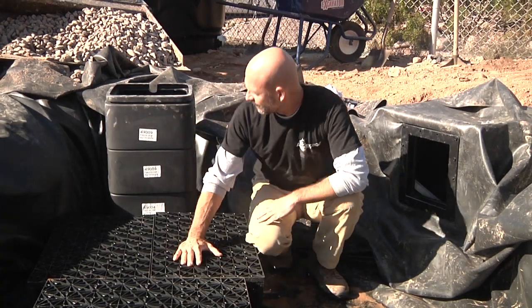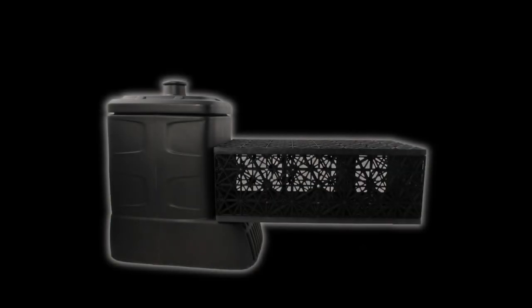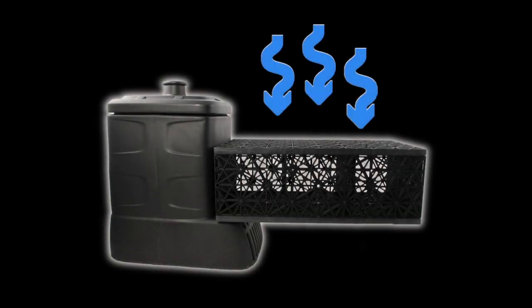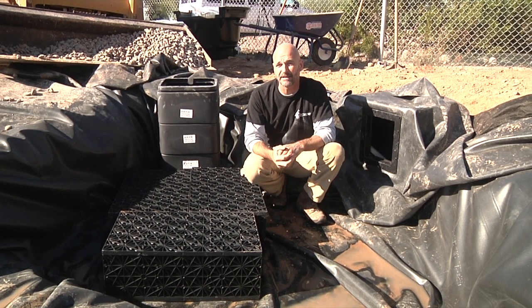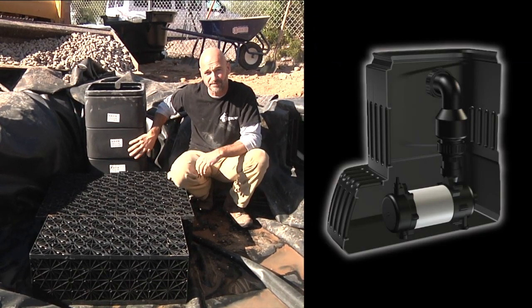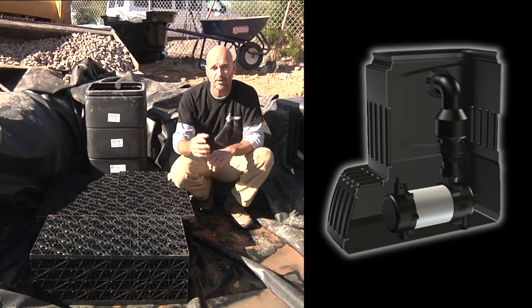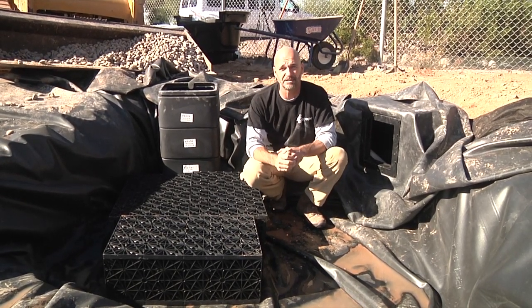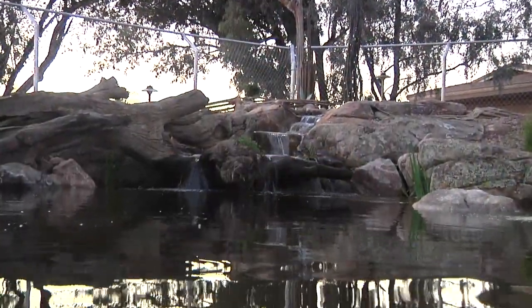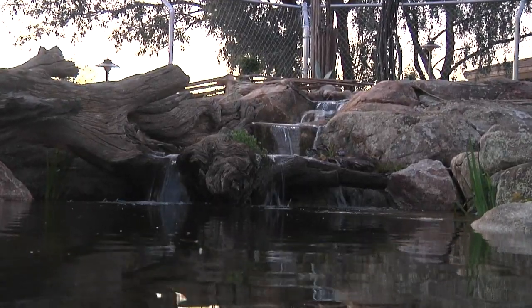Over on this other side we have our pondless vault. This is going to house two pumps inside of it. We also have a few aqua blocks in front. This is a different type of filtration — drawing the water down through the layer of gravel, down into the pumps below. As that water gets drawn through the gravel bed, you get a little biological filtration. The two pumps will discharge water into key strategic locations around the perimeter of the pond. We have jets to increase overall circulation, and the biggest pump sends all that water to our main waterfall for dissolved oxygen, creating the sights and sounds they're looking for on this project.